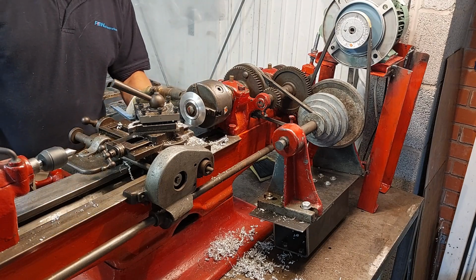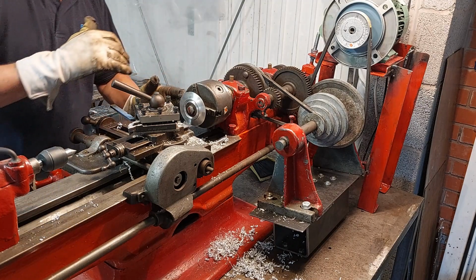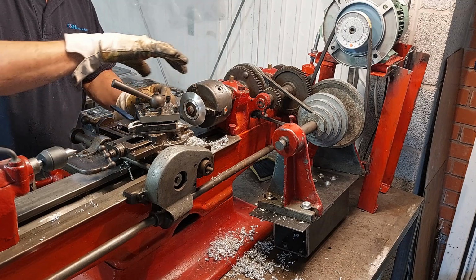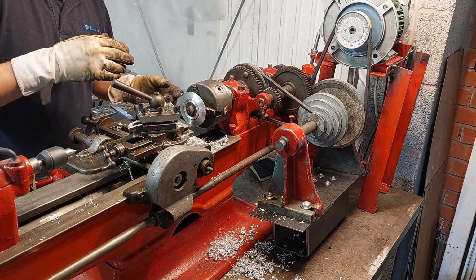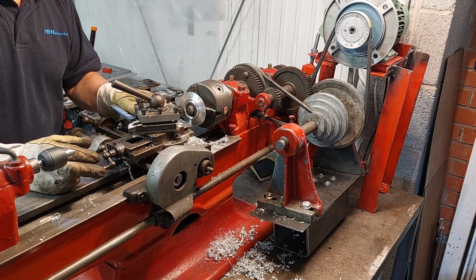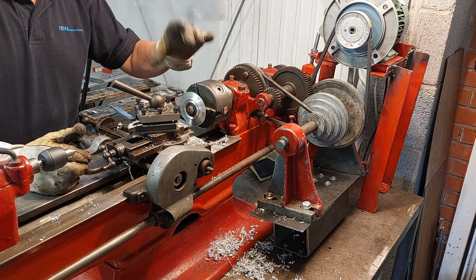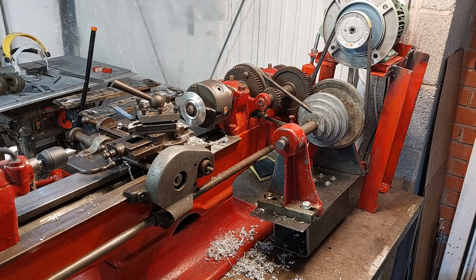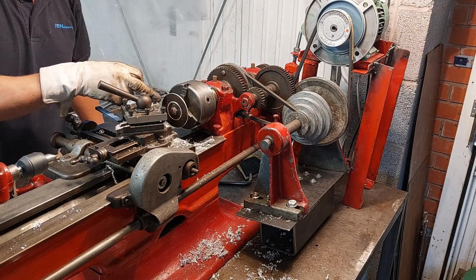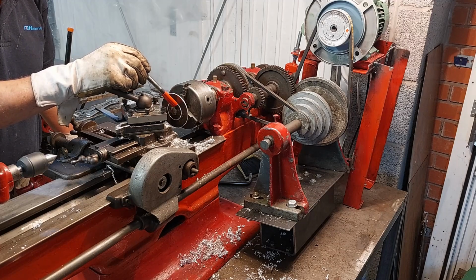So on the other side of this, it is brown, so I want it to be shiny aluminium. So what I'm going to do is machine the top surface the way I machined this surface. Now if I cut all the way through now, the whole job will not be able to be held in the machine. So the first thing I'm going to do is flip this over. I'm going to mark it with this blade here. I know where it should be for the final cut. I'm going to machine the surface and then I'm going to cut all the way through so that this disc is free, and that will be the job complete. So this is where the final cut has got to go all the way through. Now what I'm going to do is machine this surface all the way to the edge of there so it's nice and shiny.